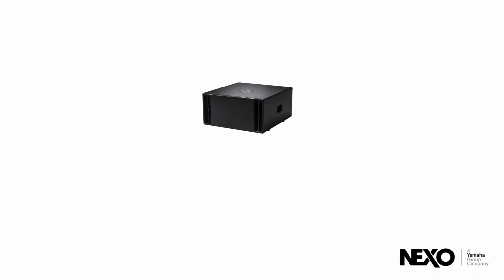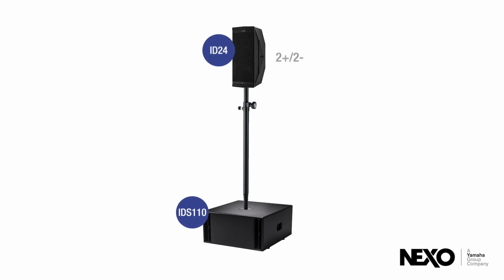The speakers are equipped with two Speakon NL4 connectors with parallel wired pins. ID24 uses the -2 +2 pins. IDS110 uses the -1 +1 pins. NEXO speakers must be used with a NEXO processor to perform at their best efficiency and safety.